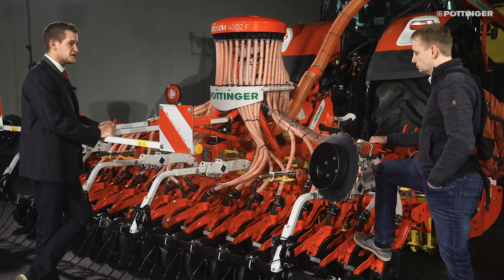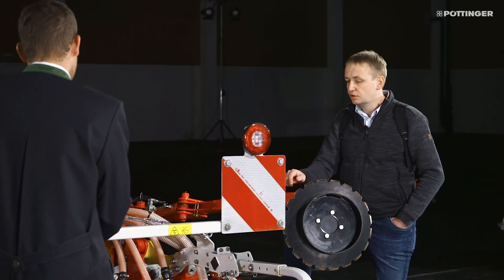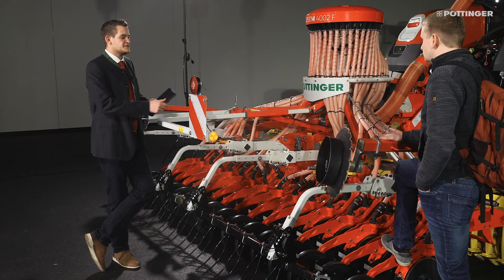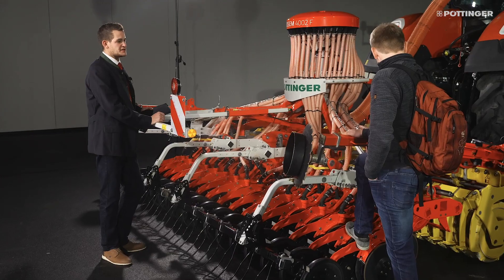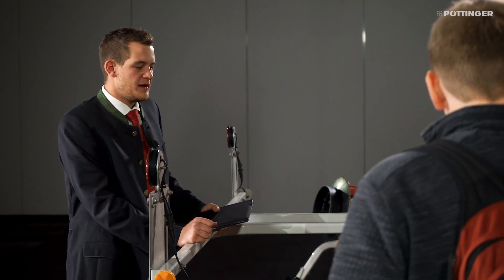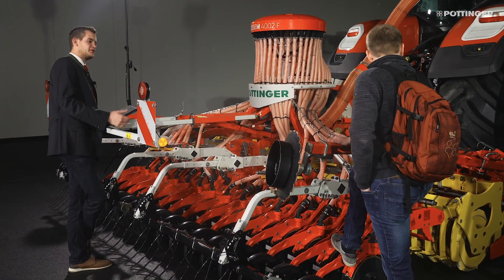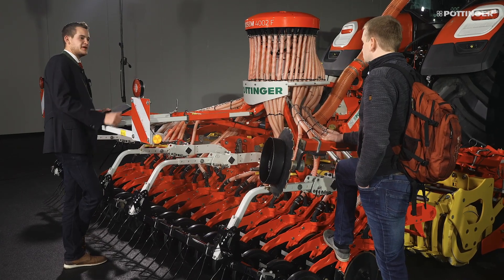The discs also have integrated scrapers, and depth guide rollers at the rear. Does that mean I have to control the depth for each row individually? No. We have a central setting system for each side, as you can see on your right — very easy to adjust using the ratchet wrench supplied. Released by a pushrod, the depth can be easily adjusted from the side. You'll notice this special parallelogram linkage, which retains the depth setting so there's no change in the angles.